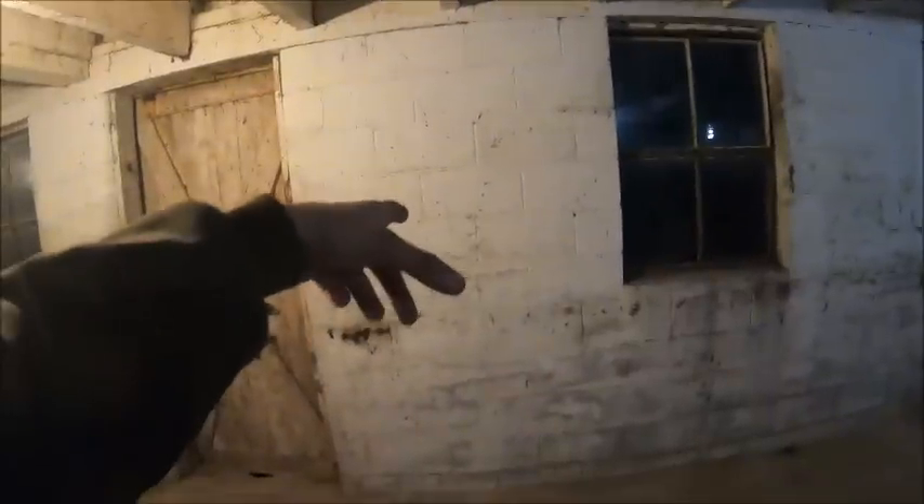I really hope this floor isn't that thick, otherwise it's gonna be a bear to bust out. Basically gonna take a concrete saw and score it, then use my granddad's electric jackhammer — hopefully it's not too tough to bust out. Getting the floor out will be phase one. Got to get dad over here and figure out exactly how big a chunk I need to cut out, but the floor's got to be out of the way so I can get to the bottom blocks. Get the floor busted out — part one. Get the wall knocked out — part two. Get a door on it.